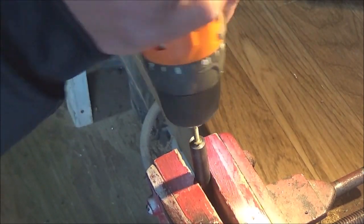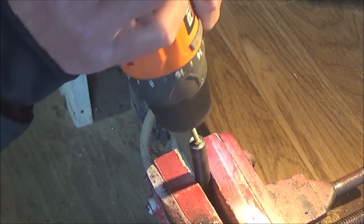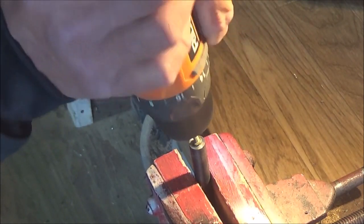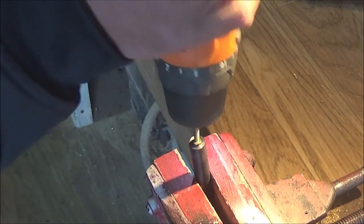And you need a screw that's going to be, in this case, this size, so that it overlaps the sides of the muzzle, so that you don't end up pushing through into the barrel. And you need that outside edge created for the crown, too, at the same time.